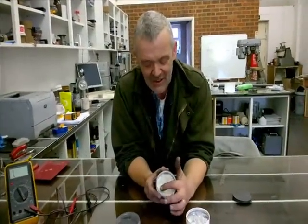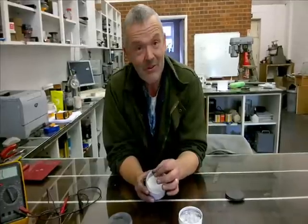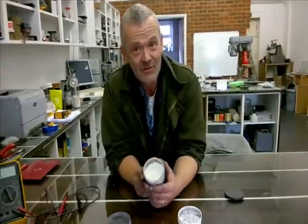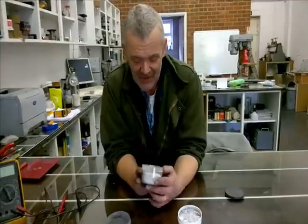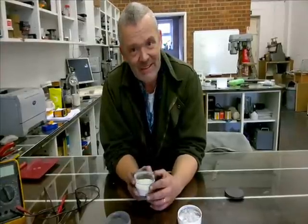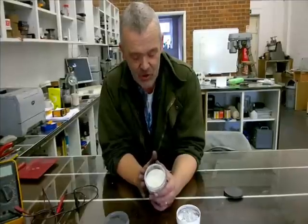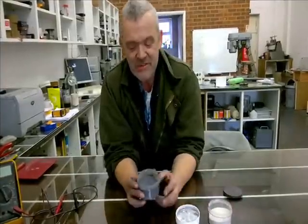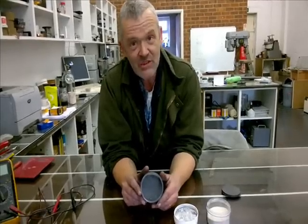And what you've got in here is a powder. Now, this powder has some amazing properties, the main one being that if you heat it to 135 degrees and squeeze it into a mould, it turns into a plastic. Now, we were looking at plastics because we wanted to toughen them up. So we invented this plastic, and we took this plastic and added 0.5% of graphene to it, which turned it this bright silvery colour, and then we squeezed it in our mould.